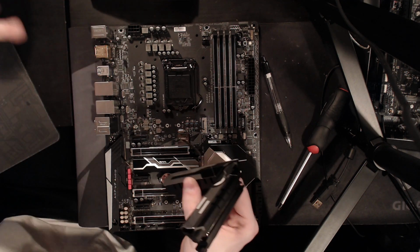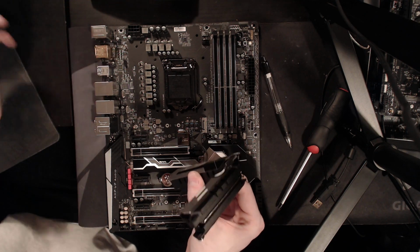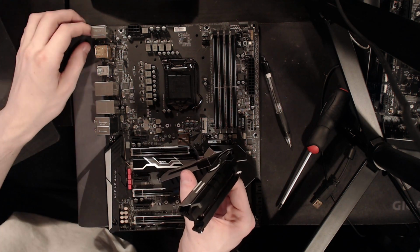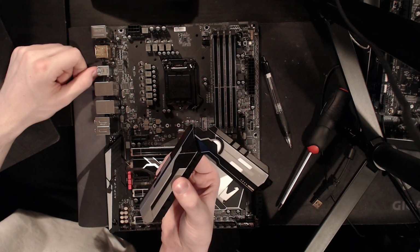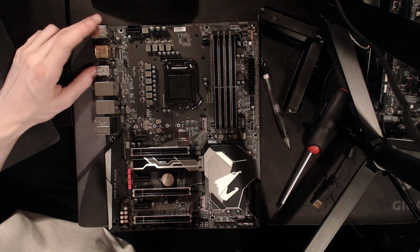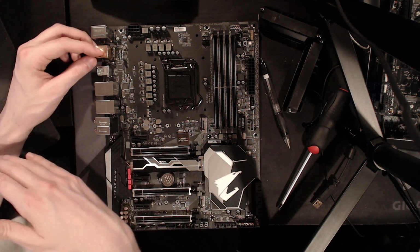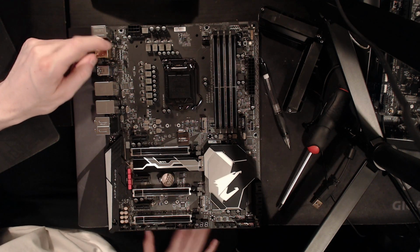And now on Z390, I expect to see an 8-core, and that's going to be another 50 amps on top of the 150 amps that Coffee Lake can do in some scenarios. There's going to be another 50 amps on top of that. And the modern art pieces are going to stop being adequate very, very quickly, because that amount of current draw is basically in line with what you would see on something like maxed out X99.